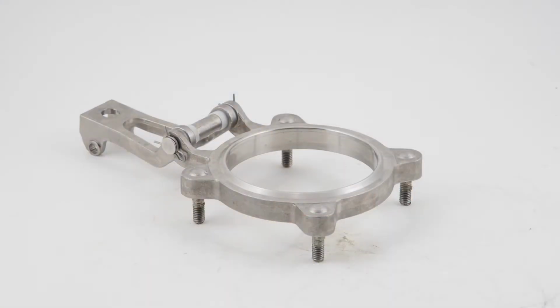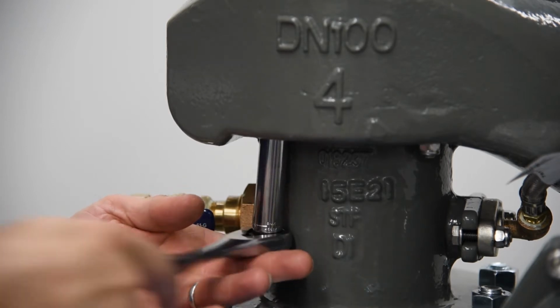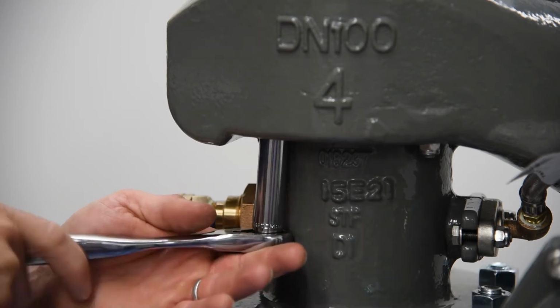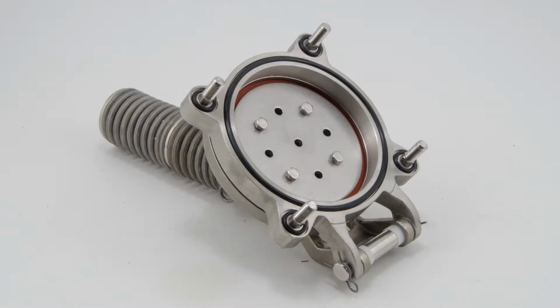If the check sealing surface is damaged, the seat will need repair or replacement. The seat should only be removed if the arm or seat ring appears to be worn or damaged. To remove, disconnect the 4 lock nuts on the exterior of the valve, holding the seat ring in place. Carefully lift it from the valve. With all the check components cleaned or replaced as needed, it's time to rebuild. If you remove the seat ring assembly, make sure to properly reinstall and lubricate all O-rings, including the stud and main sealing surface, and evenly tighten the lock nuts. Do not over-tighten the lock nuts.